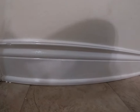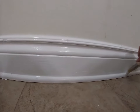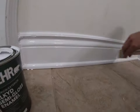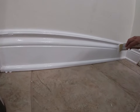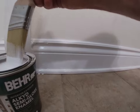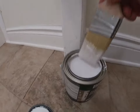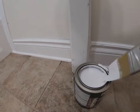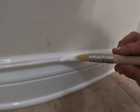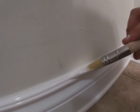See here — get the bristles close. Same thing if you have carpet. There's a hole that wasn't filled; I'll just fill it with paint. Then on the front face, just hit the whole front like this and it's already starting to dry. So again — dip it, clean off the back and sides, keep paint on the front, not the back. Sometimes you want to go a little lower because the paint will bunch up, then get your bristles right in there.